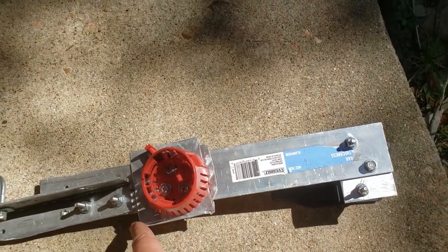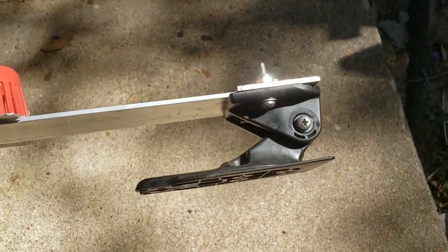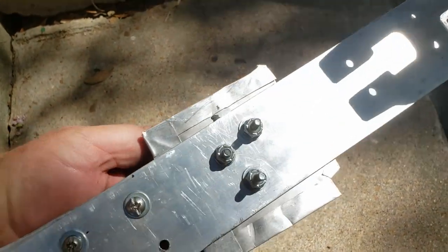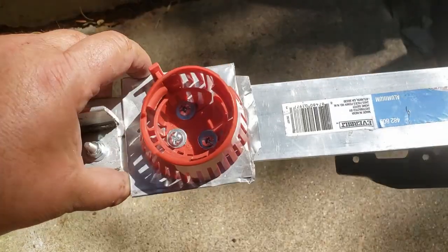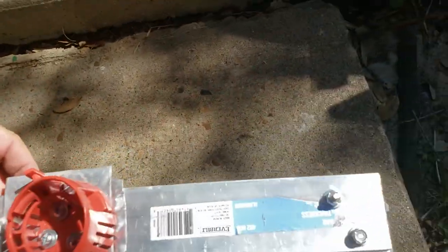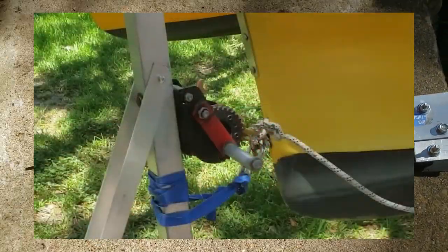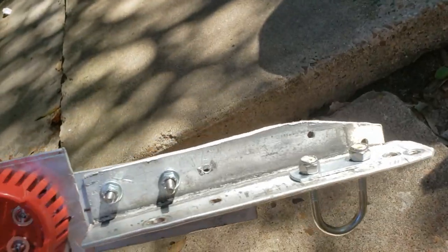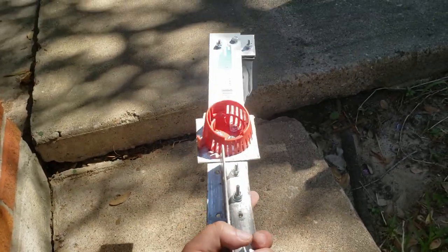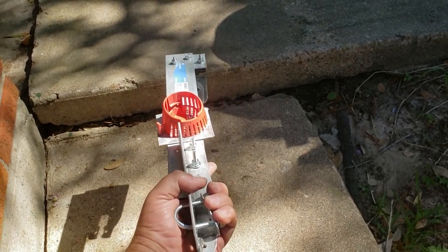The exact dimensions are two inches by about that length. At the end I had to put a little extension on it — that's the mount for the transducer. I put a little aluminum underneath there to close up the strainer on the bottom since it's a little wider than the mount. It'll keep the water down into the fin, bilge it out, and if I need more I can do it manually. It's not pretty — this bracket was actually part of a winch I had in the garage when I moved into this house. It looks like hell but it's all under the boat. It hooks to the compression post like this and just sits down in the keel.